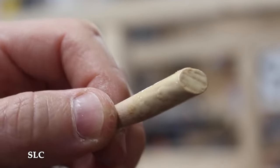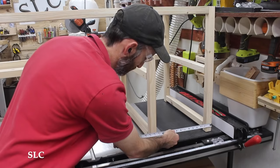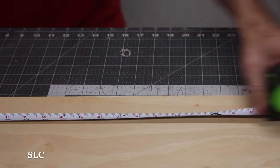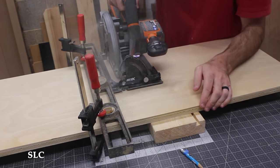I then went back to the middle legs and filled up the pocket hole with a plug. After tapping it into position, I did have to use a small saw and a sander to smooth it out. Next I measured the shelf that would go on the bottom of the legs for the computer. I checked a previous cut of plywood that was left over and it almost fit perfectly, so I trimmed it down with a circular saw.